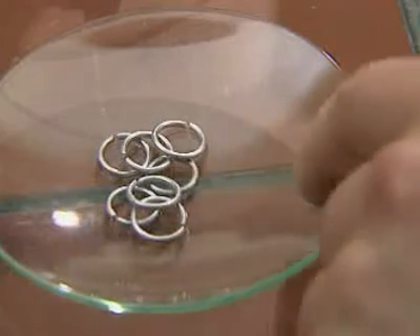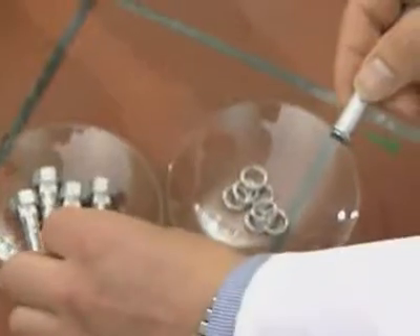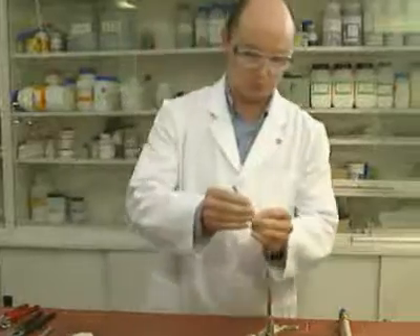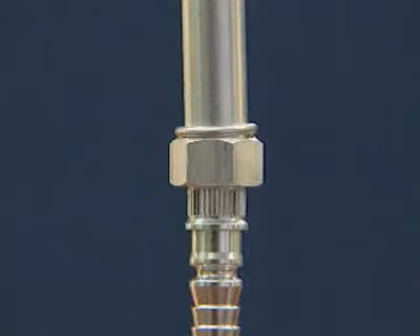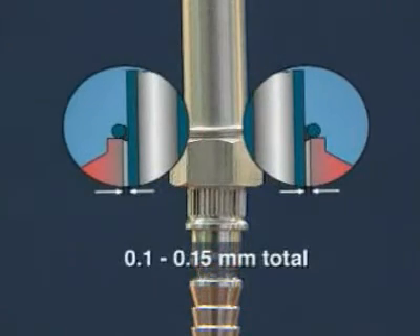After this, the components are assembled and fitted with the brazing metal — in this case, a filler alloy ring. Take care to ensure that the brazing alloy is in intimate contact with the components, but high pressure must be avoided so as not to hinder the flow of the filler alloy. The recommended gap widths are between 0.1 and 0.15 millimeters. Larger brazing gaps reduce the capillary action and may require more filler metal.